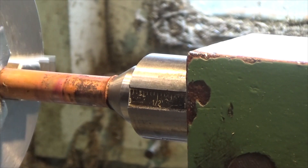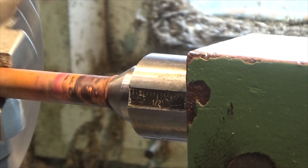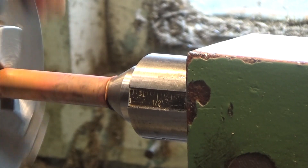You don't need to do it too much — I want to work the copper along a little bit at a time. After our first attempt we've now started to get a flare on what's going to be the petticoat. I need to soften the copper up again and repeat that process.